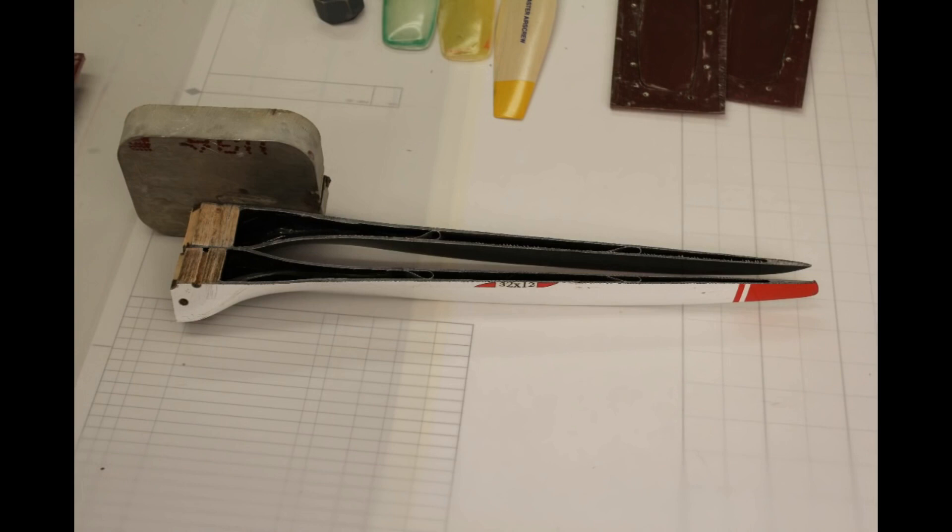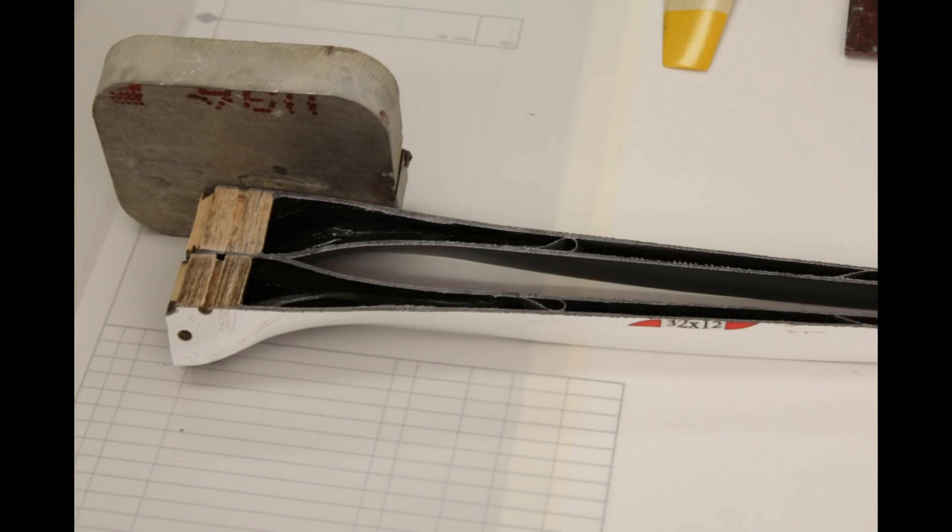Here's one of the hardest things of the whole project. I bought a $65 prop, cut it in half — it's carbon fiber and you can see it's hollow. I needed to understand how they did this; it looks to be four or five layers of carbon fiber on each half of the mold, then the mold was sandwiched together to make a hollow propeller. My props are much smaller — basically a 16-inch diameter prop with each blade being 7 inches. Mine is going to be much thinner, probably two layers on each half, then I'll sandwich them together and see what I get.